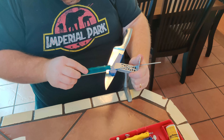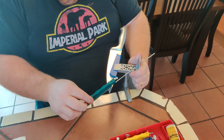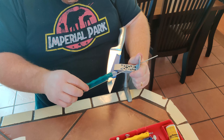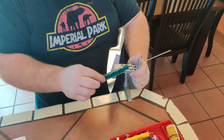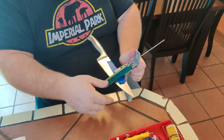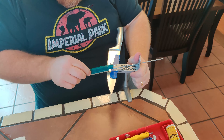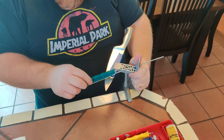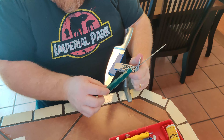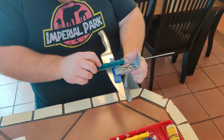The whole point of sharpening is you're actually creating a microscopic burr on the edge. So when you sharpen both sides of the blade, you're actually pushing that burr back and forth. Right now, the burr I'm creating is folded down like this. When I do the other side, it will fold it back over. You take increasingly finer stones until that burr is just microscopic. The edge at the tip is always really, really difficult to get — but it's just patience.